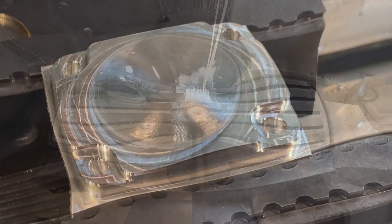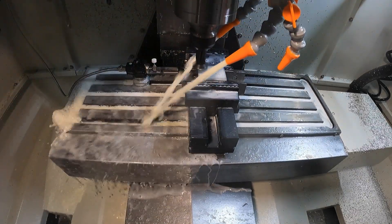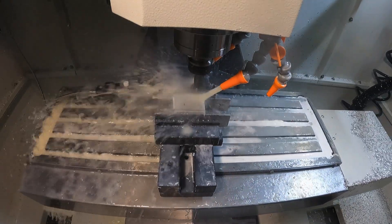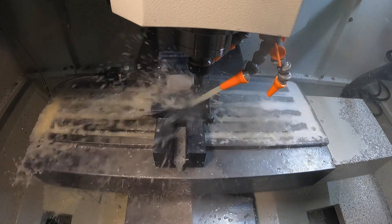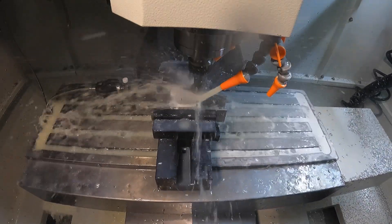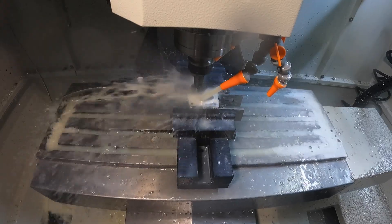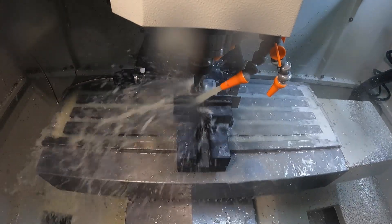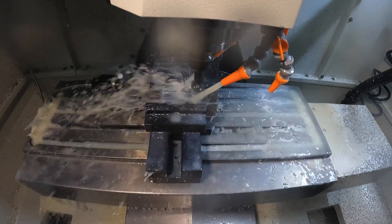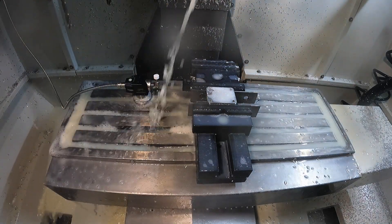Op one is complete. Now I'm ready to remove the excess hat of material using the 1-1/4-inch 2-flute shear hog. This isn't a very hard operation to program, but with the step jaws I have it gave me a challenge. I slowed this toolpath down quite a lot because I can only hang on to 20–50 thousandths on the side of the part based on the parallel height and step jaws available. I have to get the top of the part above the very top of the jaws, so I wasn't able to hang on to very much. You can see it's complete now.